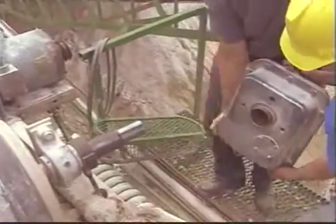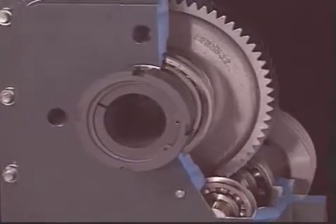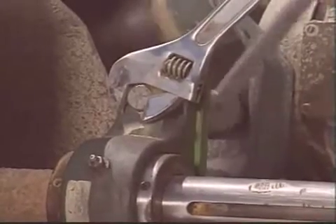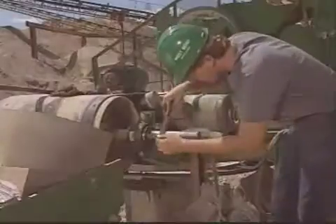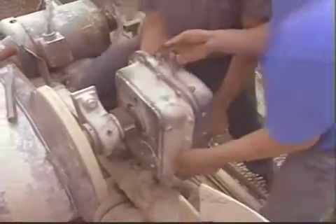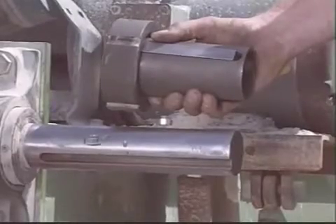With quad-drive, you get sure, positive drive removal every time without the risk of drive or bushing damage. Reinstallation of a Falk TA taper shaft mount quad-drive after repairs to driven equipment or for system upgrades is just as quick and easy. Designed to hold installation or reinstallation time and labor to a minimum, the TA taper can be used on short-driven shaft extensions and requires only bushing-length engagement.